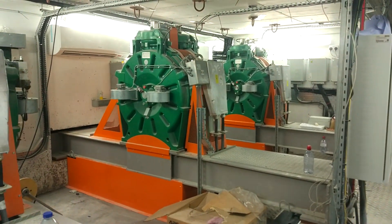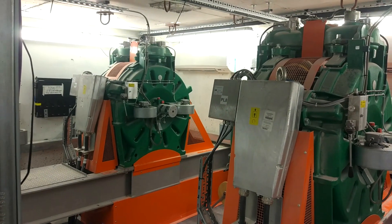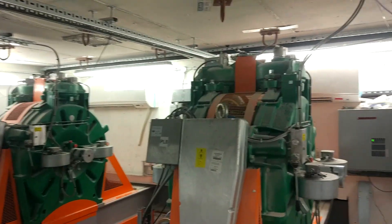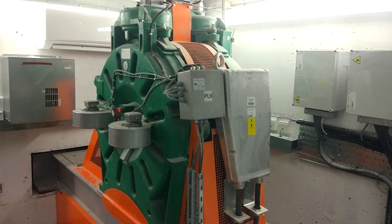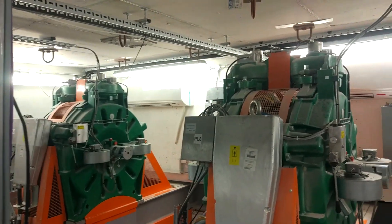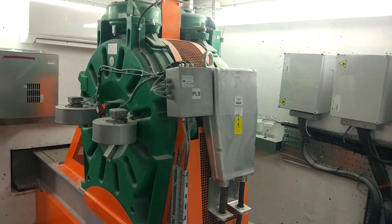In this video we take a detailed look at the Kone Ecodisc MX32, a proper high-powered Ecodisc. We've seen the MX18 and the MX18 high power edition, but this video covers the full MX32. This motor is epic — each MX32 is actually two motors with two separate sets of windings. It literally is two MX18s joined together to make a bigger motor, running with double the power. The MX32 had a large power increase for the NMX era in 2016.